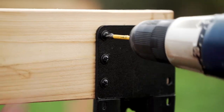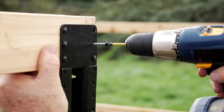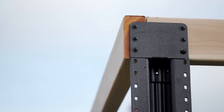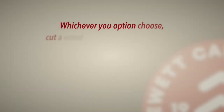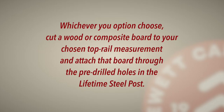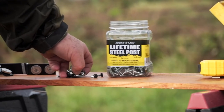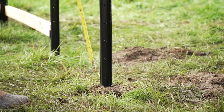If you don't have longer boards for the top rail, just measure from the corner post's outside edge to the center of the next line post. Cut a wood or composite board to your chosen top rail measurement and attach that board through the pre-drilled holes in the Lifetime Steel Post. Remember to use steel to wood screws set through the back of the post.